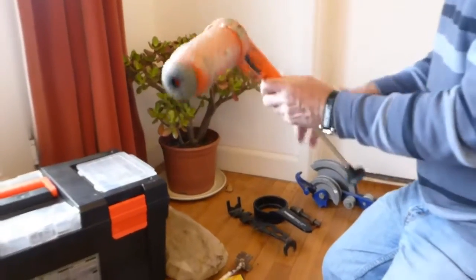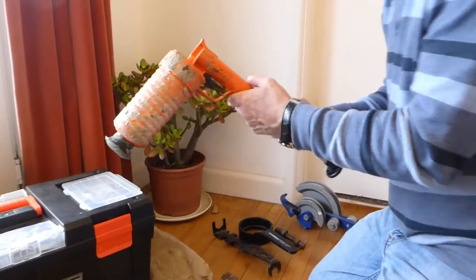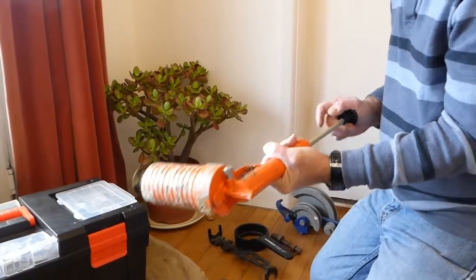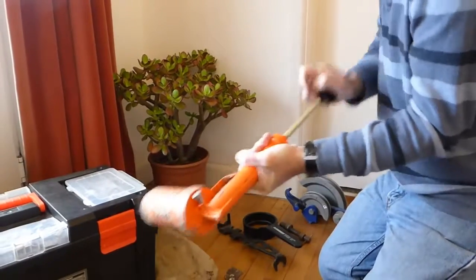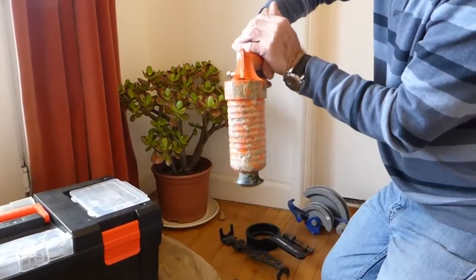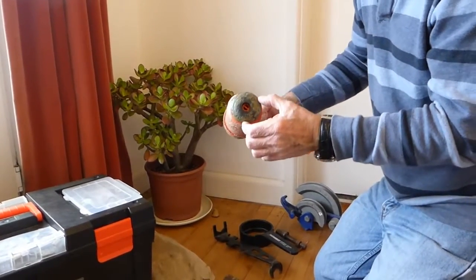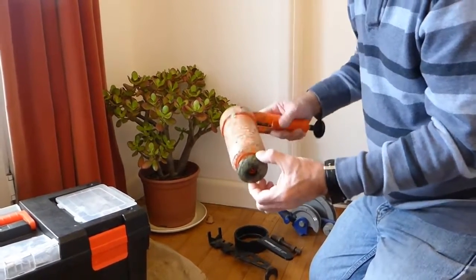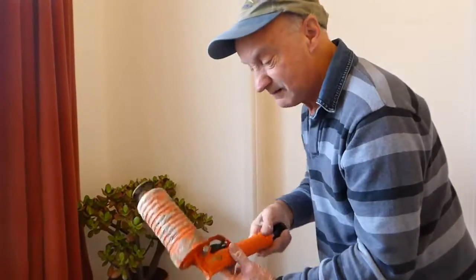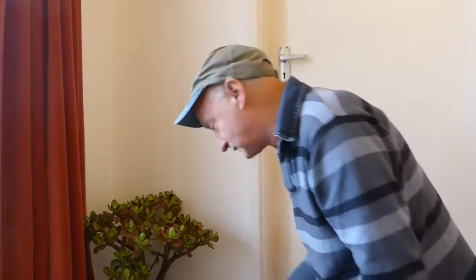This thing — this looks like a load of rubbish I know, but it's covered with plumber's mate because I've been using it — but it's actually a pressure gun. If you've got blocked sinks you get called around to clean those — this is a quick and easy way of clearing them out. You pump this like so, put that nozzle over the sink waste, or the basin waste, or the bath waste, and pull the trigger. A jet of air comes out of there and generally clears a blocked waste — not every time, but nine times out of ten. They're only about twenty quid, so if you're going out doing plumbing all the time, it's a nice little tool that I use a lot.